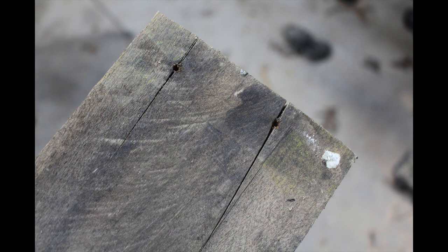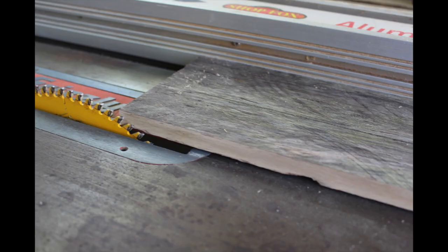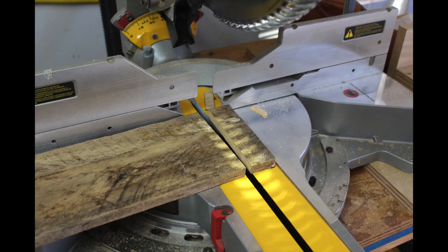A lot of times pallet boards are also warped and not straight like lumber you would buy from the store, so just be patient with them. I want to end this video on a safety note and reemphasize that you need to be real careful as you run these boards through a table saw or a miter saw — hopefully you've gotten all the metal and all the nails out. I'd recommend getting a handheld metal detector just so you can verify there's no metal in the area you're going to be cutting, because if you do hit some of these spots, you could run into safety hazards, and you could also end up ruining your blade.